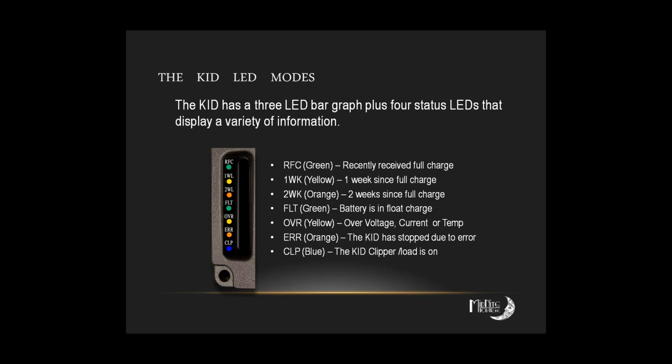Okay. Yeah, if you do happen to go over voltage, it's going to let you know. We have Hyper VOC, which means you're protected. It's a little bit different from the Classic. I don't know if anybody here is familiar with the Classic, where you get the Classic rating plus the battery voltage, and in this case, it is the rating of the KID, which is 150 volts plus 12. So if you're in between 150 and 162, you're not going to hurt the controller, but it does go into Hyper VOC, which means it does go into resting, and therefore it's not processing any power. So it's counterproductive to design a system where it might just bump up a little bit over 150, although an awful lot of our customers do seem to want to try that.